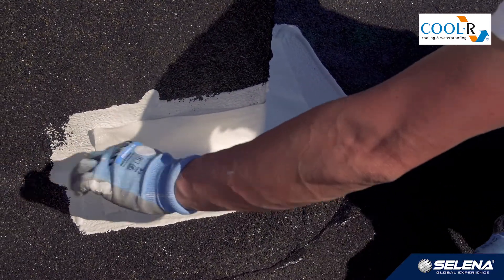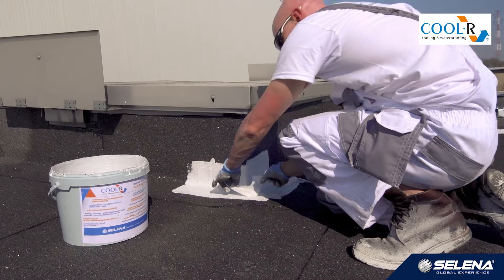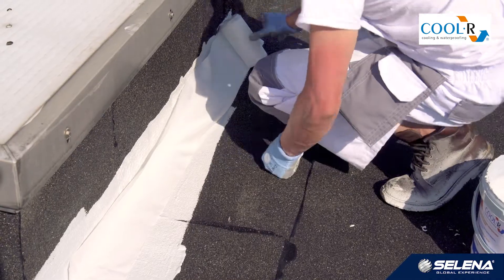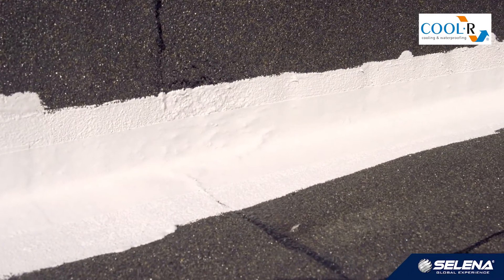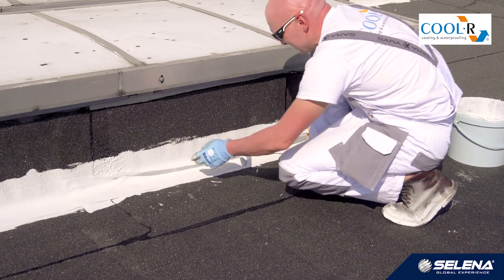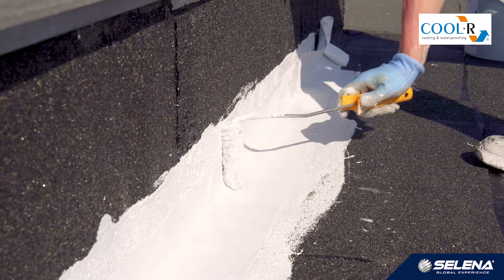All spaces where the fabric is detached should be immediately redone or sunken in resin to close the gaps. While overlapping the fabric, it is also necessary to apply resin between the two layers of fabric. White spots under the fabric mean there is not enough material under the fabric and that it will result in lack of adherence to the surface. Flashings are the most time-consuming stage of the works. During the process, we need to pay attention to the proper adhesion of the fabric to the surface.